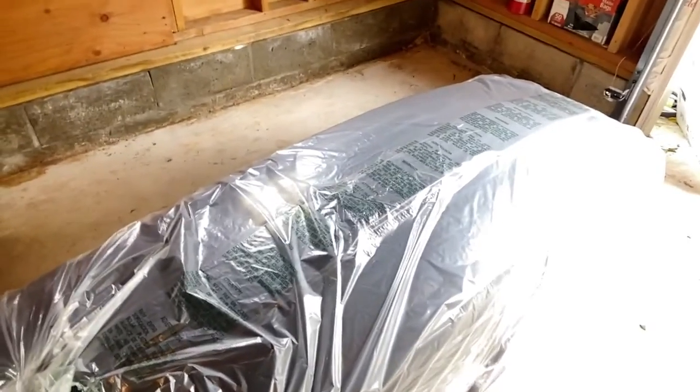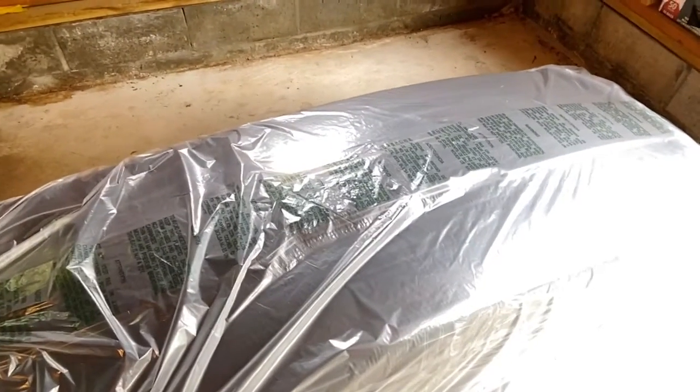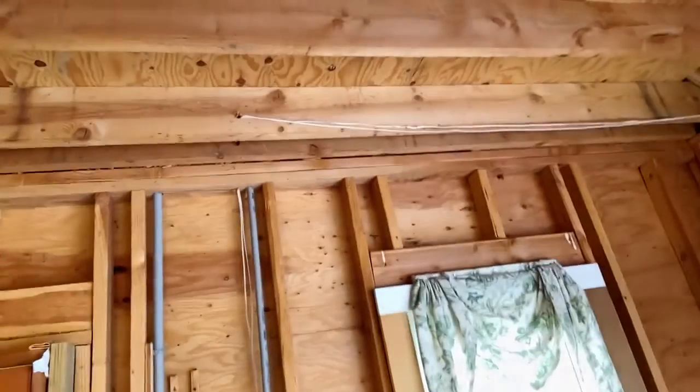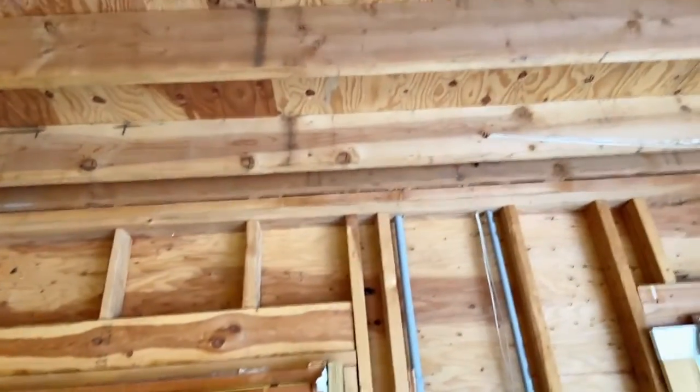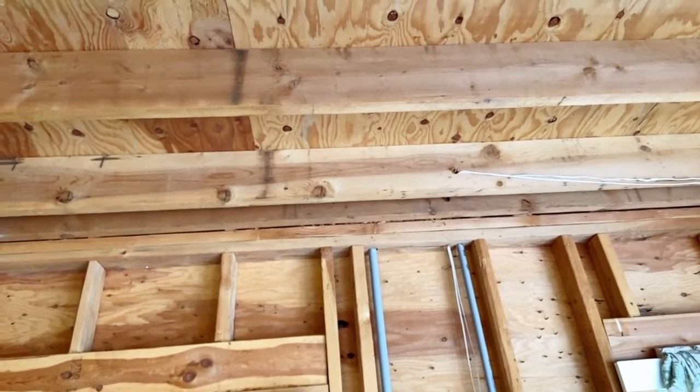The rule of thumb is you want to simply divide the length of the Pulley in half. It's 91.5 inches. So let's say 45 inches. That is going to be the space between the two pulleys. So I've got that marked out, and I'm going to start marking the pulley holes and drilling them in.